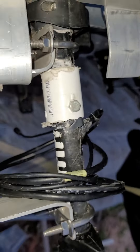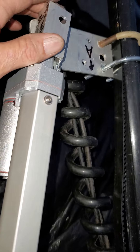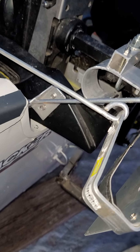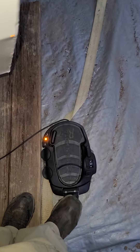I've got the 360 down here at the bottom. MegaLive is going to be right here in this area. It's a little clanky and noisy — I've still got some adjustments to make. But the rod for the MegaLive comes up through a bracket right there. The MegaLive landscape mode is working off of a joystick on my front chair. That rod goes down and puts it into the landscape mode, which it is in right now, pointing straight down. Whenever I deploy this system, it's going to automatically put it in the forward position. There's my foot control and I'm going to tap my foot control with my foot.